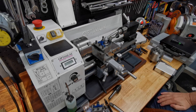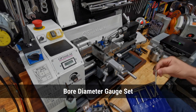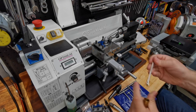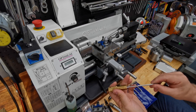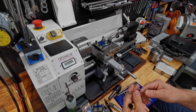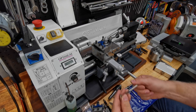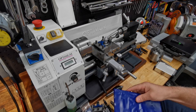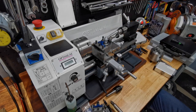One last item I've spotted — these sets are really cheap and you wonder if they'll be any good, but yes they are. You squeeze them together to set for an internal diameter, then tighten it up, pull it out, and use your calipers to measure. There's not really a lot that can go wrong — you can't really make them imprecise — so they work perfectly well. I have used them for internal diameters; it's a little bit more convenient than always trying to stick your caliper tips in there.